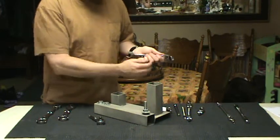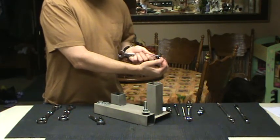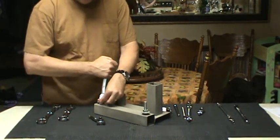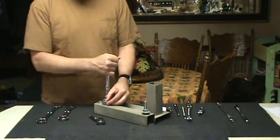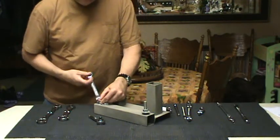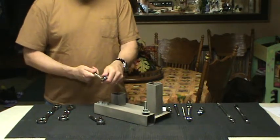Your plane of rotation is no longer with the bolt or nut that you're trying to loosen, and it moves with the head, and it actually tries to pry it off the bolt. As you can see, this is no longer a force that is of any value loosening or tightening any bolt. It's twisting it off. Even down at a low angle, it's still more of a twisting action instead of a turning action.